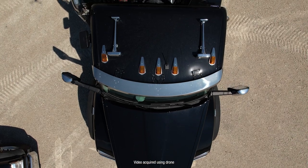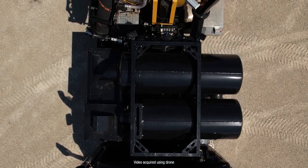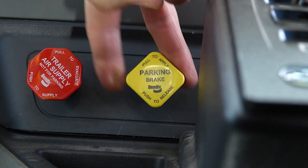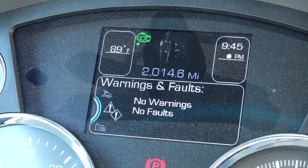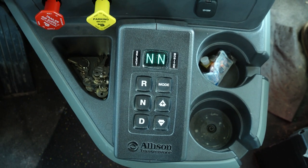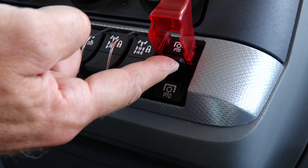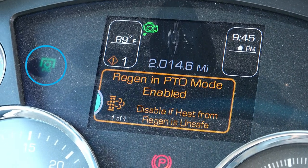This unit has a Kenworth T880 chassis but can also be equipped with a Mack Granite chassis. There are different operation procedures between the models, so make sure to refer to the operating and maintenance manual. Verify the parking brake is set and start the engine. Check gauges and warning horns, and verify NN is illuminated on the transmission display. If it is not, press the N button on the console. Press and hold the brake pedal while lifting the red safety guard and engaging the PTO-1 rocker switch. The hydraulics should engage in 10 seconds or less and an icon will illuminate confirming it is on.